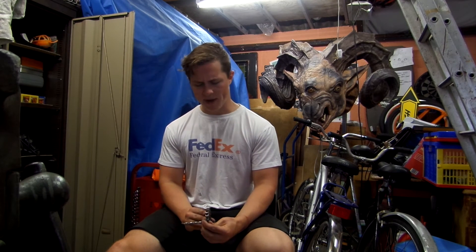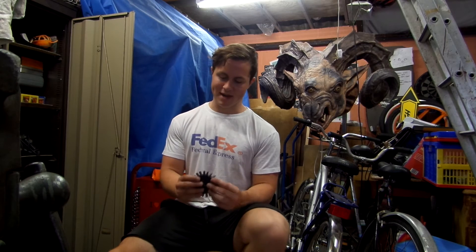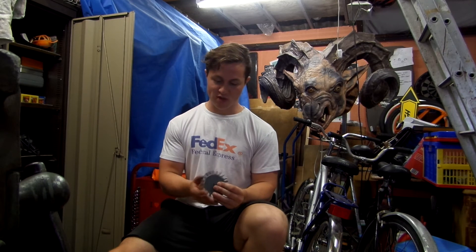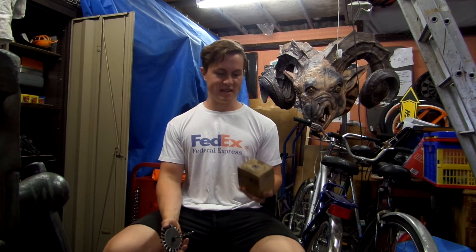This was a really tricky part, but I found the best way was to use a sanding drum on the drill press and manually go in and sharpen each blade individually. It does take a while, but it produced a really good result and I'm happy with the way these went.